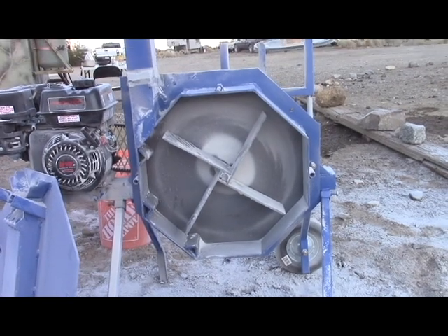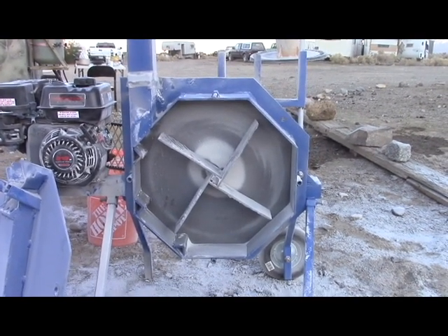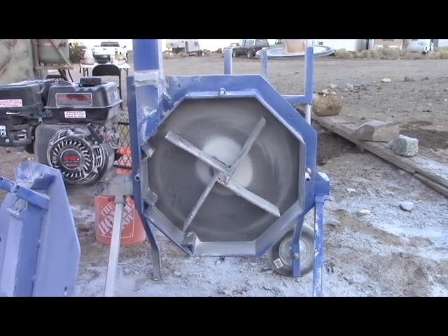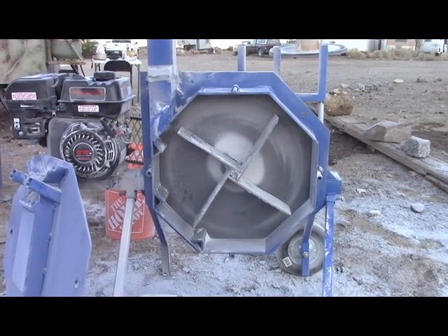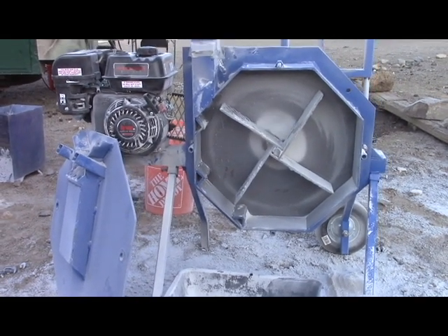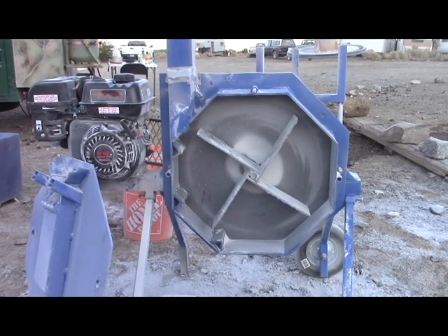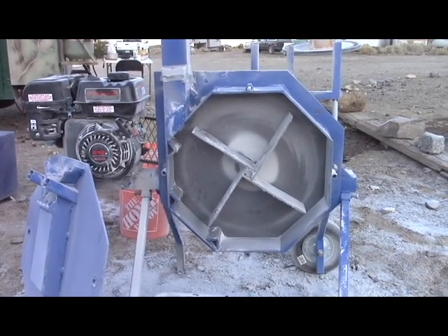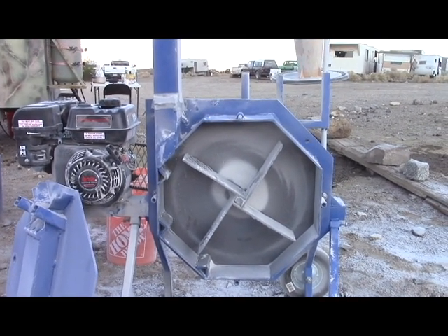You can see the wear patterns inside the mill. So far it's only had maybe a hundred pounds total through it, so there's really not much wear going on. I don't like the angle iron because it creates dead spots behind it, and I'll probably make a production model with actual liners so you can go ahead and change them out and resurface them as needed.